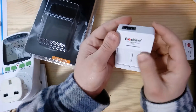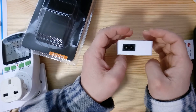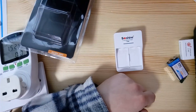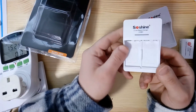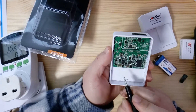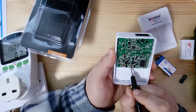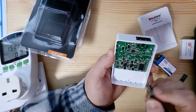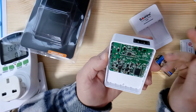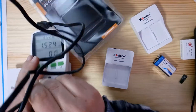I got some of these SoShine chargers, which seem to be a reputable Chinese manufacturer. I was tired of charging on my power supply and forgetting about it. The first unit arrived about a month ago and immediately blew up one of my batteries — there were tantalum capacitors inside, and one literally exploded, leaving burn marks on the casing. I replaced them with ceramic capacitors.